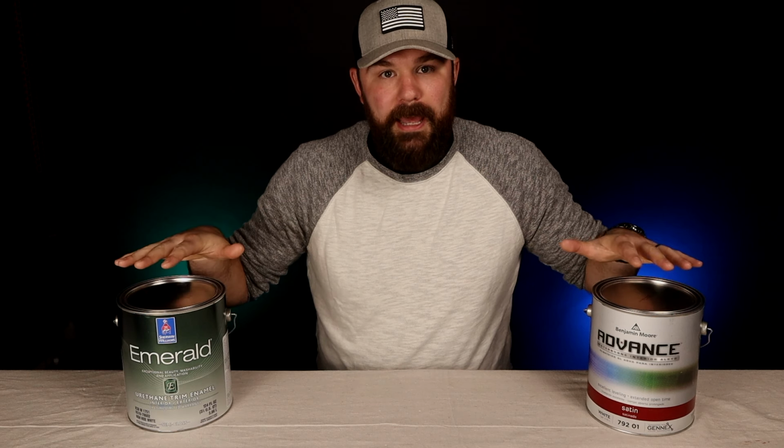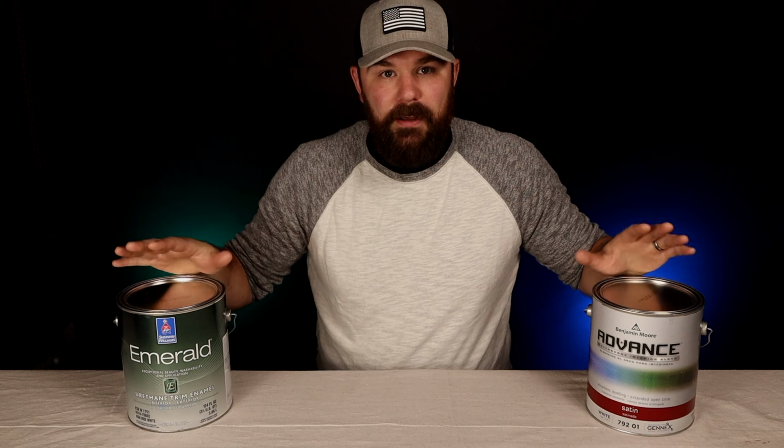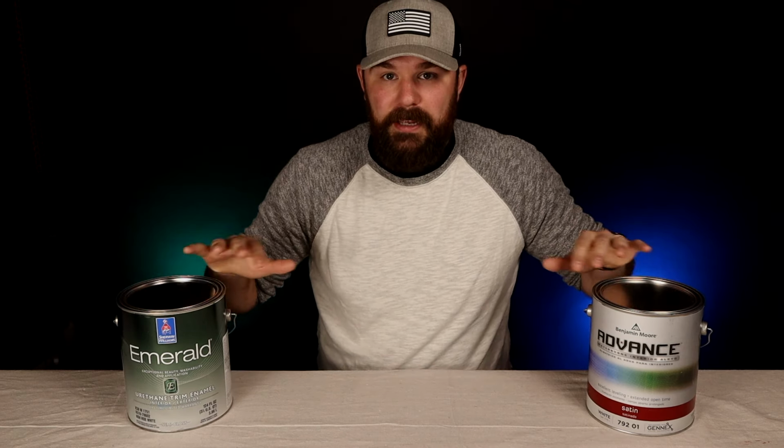These are both hybrid products, which means the paint manufacturers took a water-based formula and added oil resins to them, which then starts to take advantage of some of the properties of an oil-based paint, but keeps the ease of use of a water-based formula. And we will cover that as we move along in this video. If you want to see more specific reviews of both of these products, I actually did a review of Emerald and also of Advance individually. I will link to them up here.